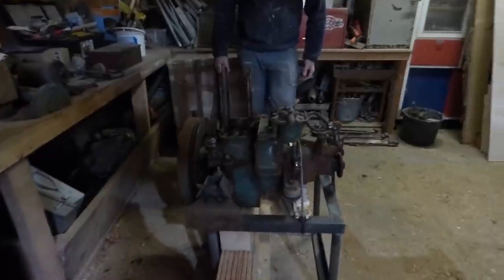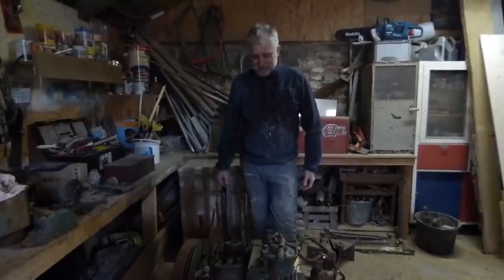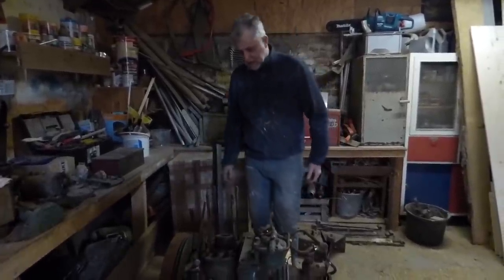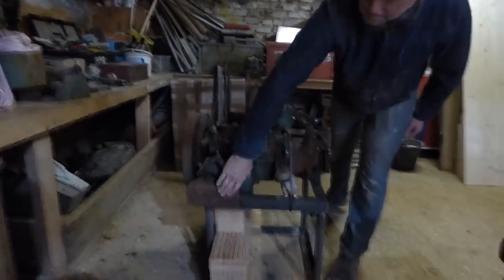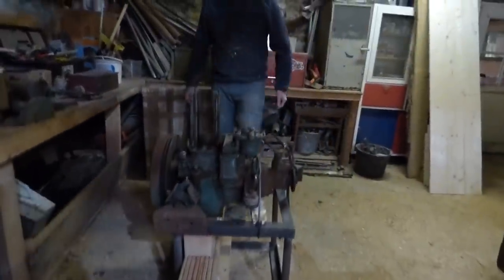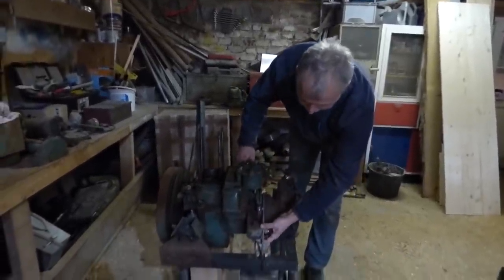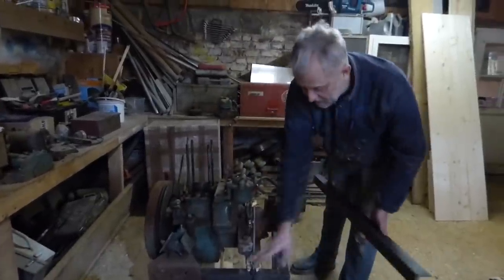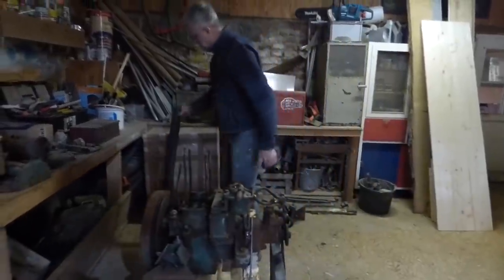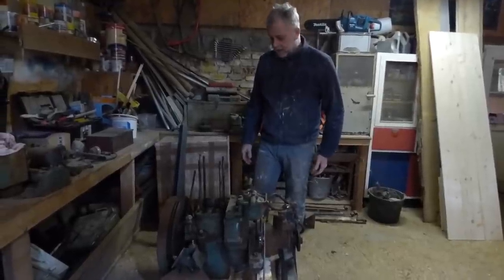Remember this, the trusty old Volvo Penta MD1, which, as I told you way back then, is progressing very slowly. But we've done a bit, or I've done a bit, more to the point. As you can tell, it's mounted up on the stand now. Got these brackets welded on both sides. The aft engine mounts, which are here, still not fixed up. I've got a bit of angle iron here that will be going across there for the aft engine mounts. But I'll pop the gearbox on for now, just to line up the engine mounts so we can get that mounted properly.